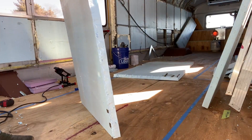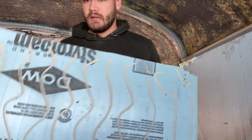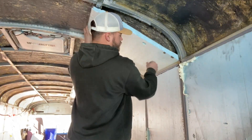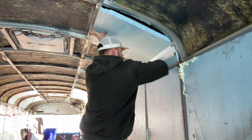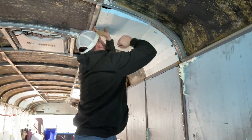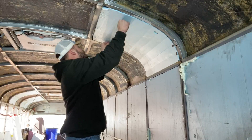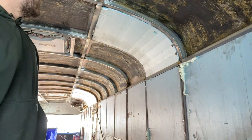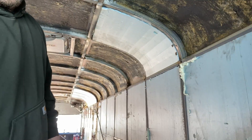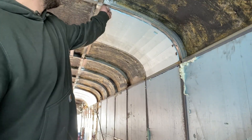So now we're going to put it up into place. I got my piece here with just a little squiggly pattern of glue on the back. Got my scores down at this end. We're going to put this end up in like this and just kind of punch it in. If you cut it right, it should fit just fine. You can see the score lines. And there she is — looks pretty good. It follows the contour pretty well. We're going to put tongue and groove over this, and any little bulges — when we screw it down, it'll push the foam down. I think we're going to be good to go.